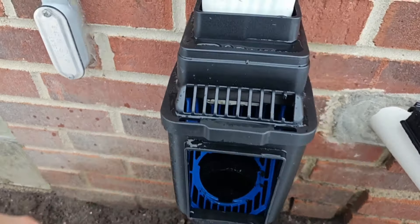When we do have a thaw and we're taking water off the roof — right now the snow is melting at 34 degrees and we have a steady flow of water — as long as this is not froze solid, we'll be able to remove water through our underground buried downspout system. Now, the cable for gutters is a completely different world. We're using plastic plumbing heat tape — it's 8 watts, inexpensive, about a dollar a foot. If you're looking to keep your gutters from freezing up, you'll need a rooftop heat cable, but stop right before you get to the vented clean-out leaf filter and do a little horseshoe with your heat cable.